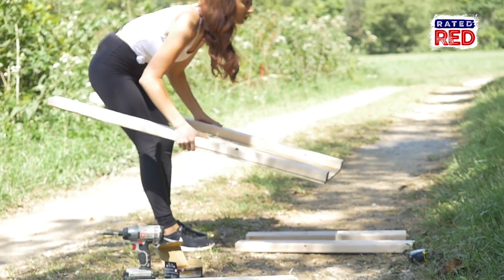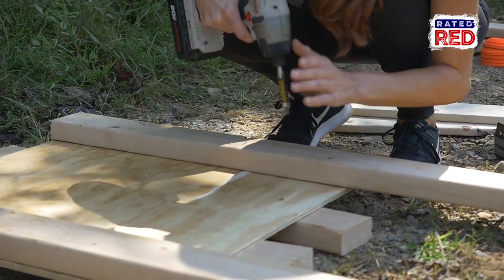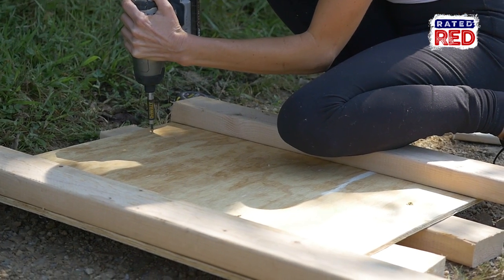Take your plywood with the legs and put it on top of your V. Make sure your 2x4s on the V have a 2 inch overhang on the bottom. Now screw these in from the back using your shorter screws.